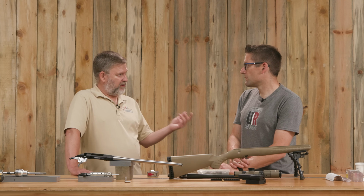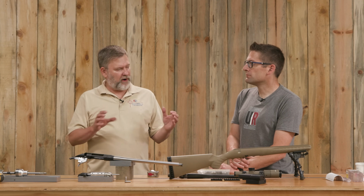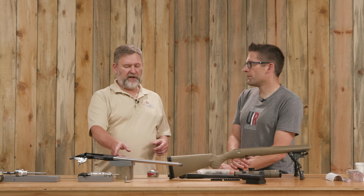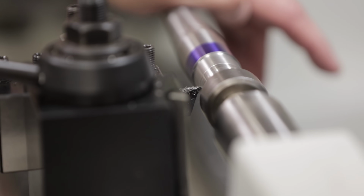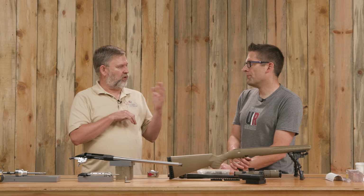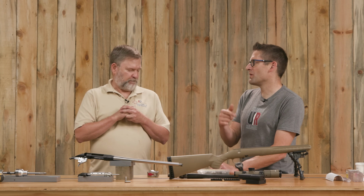Chambering is very different from the Gordy method and whatnot. We've threaded and turned the barrel, and got everything prepped in this setup where it's on the center. The final thing we do there is a skim cut on the shank of the barrel. What that does is it makes the outer diameter of the barrel concentric to the bore as best it can be. That's for this method. If you did this with Gordy's method, it wouldn't get you anywhere near close enough, where you're dialing to the inside of the bore, on the grooves.